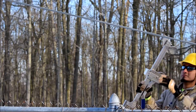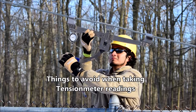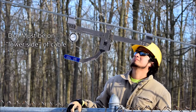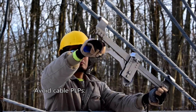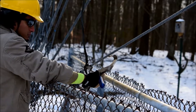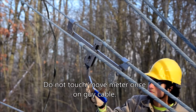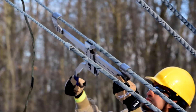Here are some examples of things to avoid when taking tension meter readings. When taking readings, the dial face should always face the user and must always be on the lower side of the cable. Avoiding contact with PLPs ensures accurate tension readings. Users should always be aware of ground hardware, cable damage, overgrown vegetation, or anything on the cable that could block full contact between the tension meter and cable.